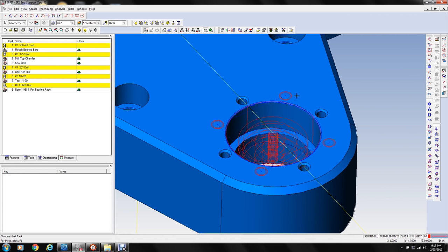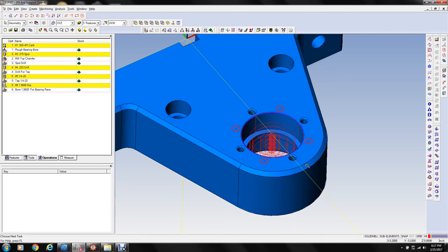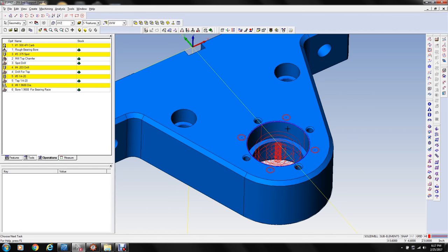I've rotated these four holes 45 degrees because remember we have that tapped hole that we didn't really want in here, and it's going to intersect this hole if we leave it right here. So I rotated them so that we wouldn't have that problem. They just hold the end cap on, so it's not going to make any difference, because it'll just rotate the cap 45 degrees, and it's symmetrical, so it doesn't really matter. It just covers the end of the shaft, keeps coolant and shavings out of the bearings. Let me run the graphics here